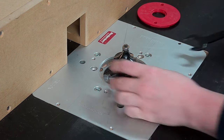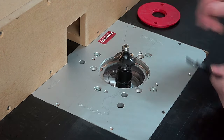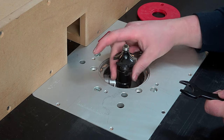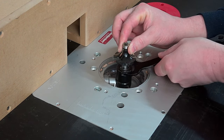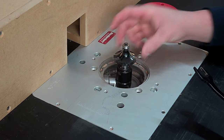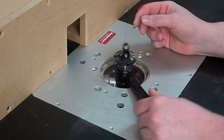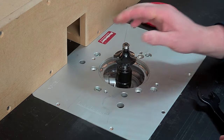To fix that, I'll loosen it again. I want to put it down, get it finger tight, lift it up a little bit — a couple of millimeters, doesn't need much — and then tighten it. As I tighten that nut it's pulling that shank down and it's got clearance to actually move downwards. So when I tighten it down like that, it's good and tight, good and secure — it ain't going anywhere.